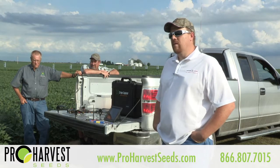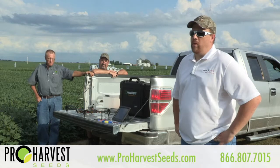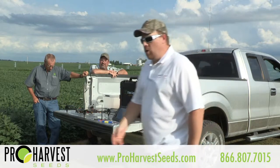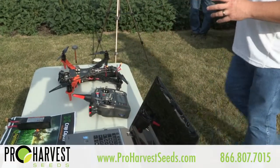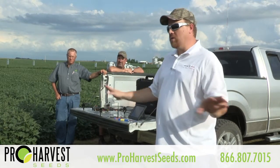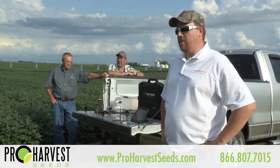What about a situation where everybody here has drones, cross signals? Won't happen. It's working on a much, much more sophisticated scale. Think about it like your garage door opener. You've got two garage door openers, they're both working the same way, but they lock onto a frequency. We've got two different radio systems on here that are 2.4 gigahertz. You've got your radio that controls the aircraft, and then your automated portion, which talks to the iPad. Each one finds its signal to lock onto, and once it finds that signal, it doesn't move. It stays there and ignores everything else. So you could have 30 people running shoulder to shoulder with these things, and the only thing that's going to crash is them running into each other, not their radios.